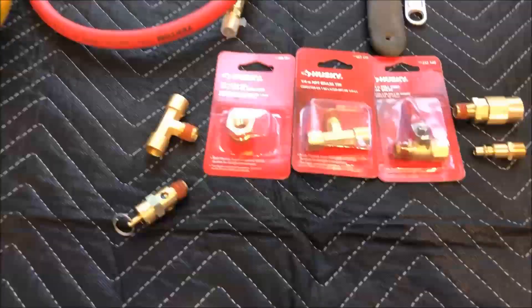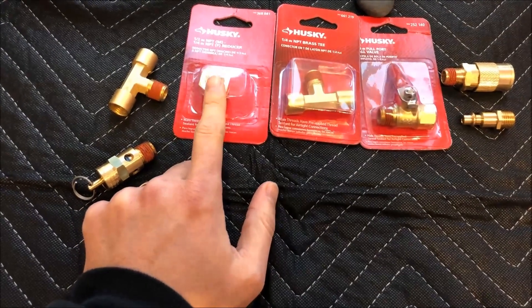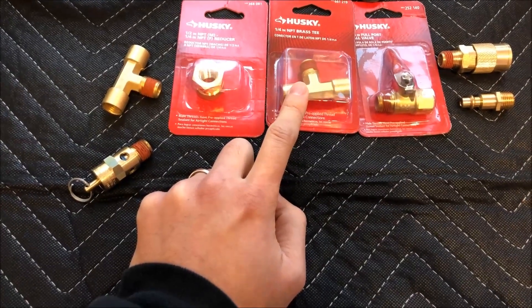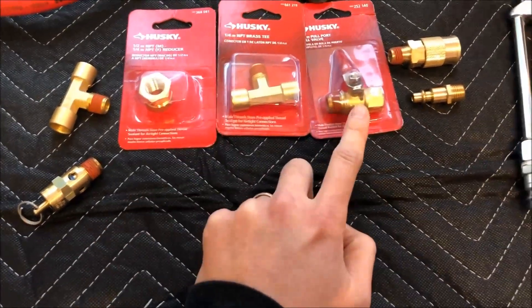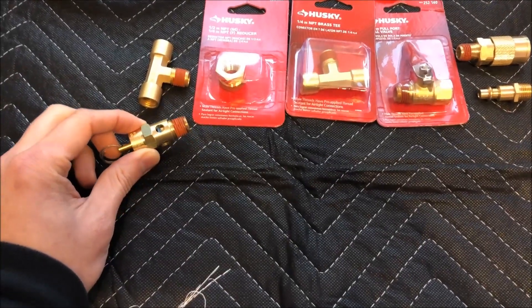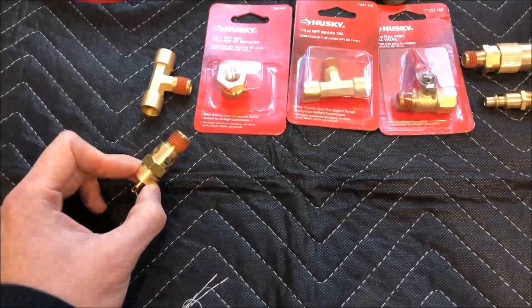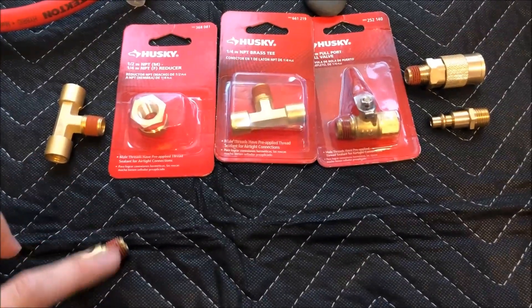I'm basically going to remove the stock valve manifold that's on the tank. You're going to need this reducer that comes off the tank, a quarter inch brass tee. What I've seen in other YouTube videos is that right off of the tee, they'll either put the gauge and then the shutoff valve. But what I'm going to do is tee it and then tee it again so that you can also add a pressure release valve for safety. The tanks I've seen are mostly 125 PSI max, so you want to make sure that you size the pressure relief valve properly. I had to get this on Amazon — everything else I got at Home Depot. I will put the parts list in the description below.